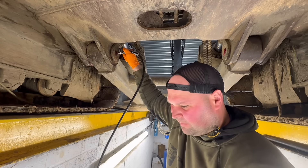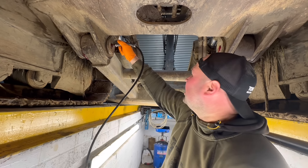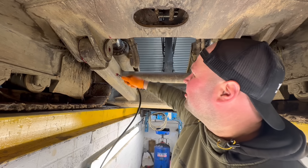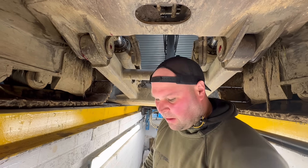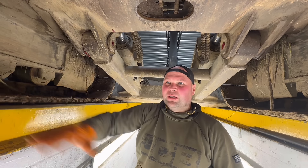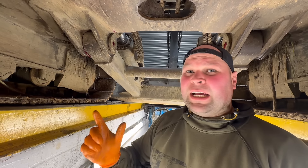It's got plenty in it, and then we'll get it out. I can't check the hydraulic oil yet because the boom's got to be in like the down position. It's all starting to come out. So we'll check the hydraulic oil when it's outside — you've got to have the boom in a position where it's properly down with the arm right out, otherwise you don't get the right reading in the hydraulic oil tank. Right — we'll get it outside.